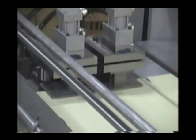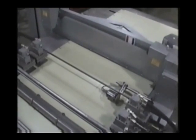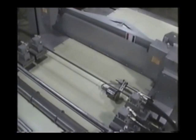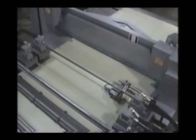The hydraulic press die units are quality die post and pin construction, designed for years of service and ease of maintenance. All die tooling is made of quality high-carbon, high-chrome tool steel. Positioning of dies is done through lead screws and handwheels with micrometer readouts.